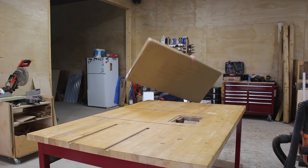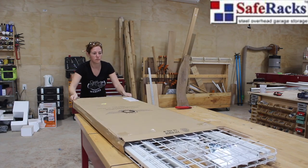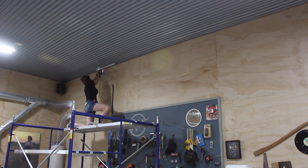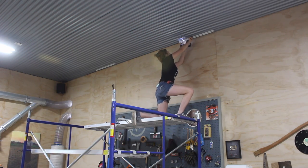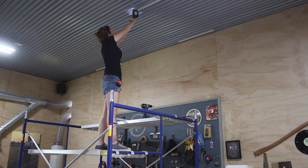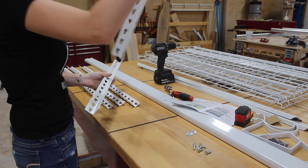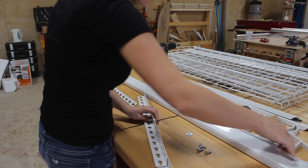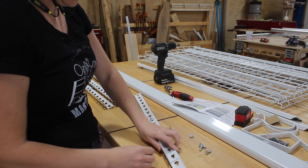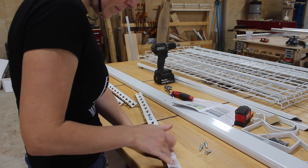The last thing I decided to do was install some ceiling-mounted steel storage racks made by a company called Safe Racks. I've installed these in my garage before, so I was already familiar with how quick and easy they are to install and how handy they are at getting larger items off the ground, away from lower valuable wall space, and up higher where they're still accessible. I started by placing the ceiling brackets into my joists — since I have rows of screws attaching my ceiling material to the joists, these were very easy to locate. After getting the mounting brackets attached, I went to my workbench and started assembling the arms, which is where you adjust the height of the entire unit. I measured the totes I'd be storing and decided three feet of drop would be more than enough.